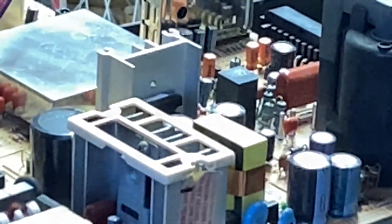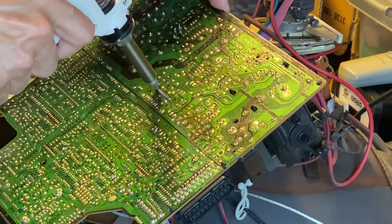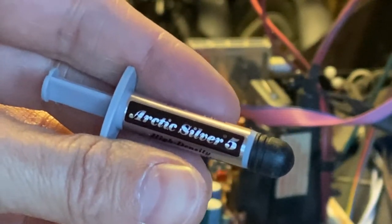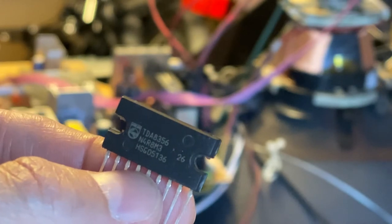I'm going to start removing the chip. In order to do so, I have to unscrew it from its heat sink and then desolder the IC from the motherboard. This is fairly quick and easy as there are only nine pins to desolder. Removing the IC reveals that we will also need some thermal paste — in this case I'm going to use Arctic Silver 5. Here's the desoldered chip, and here's the new one that paradoxically looks older.